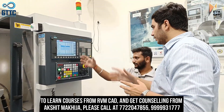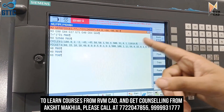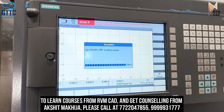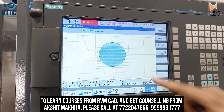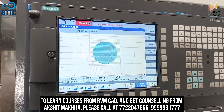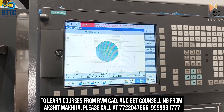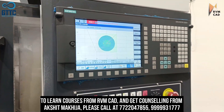Can you show a simulation? This is a basic program structure where we have created a pocket and one cycle. Now we are going to simulate it. It is showing — this is the first roughing stage. The green thing you see is the actual material removal, and the red lines are non-cutting actions. In every cut it is removing material. This is a simple face milling operation, and now it is doing a pocket. The Siemens controller is student-friendly because it is easy to learn and understand.